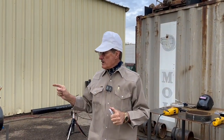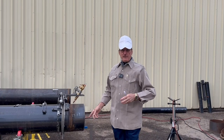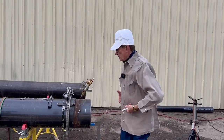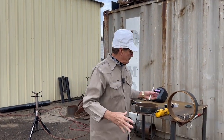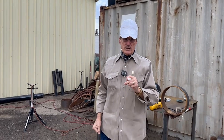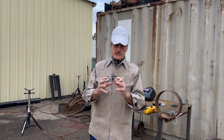Now why is that important? High-low. If you're new and don't know what high-low is: pipe is egg-shaped when it comes from the factory. It's only guaranteed for so many inches to be truly true to that dimension — after that it's allowed some tolerance and it can be like this. We call it egg-shaped. This pipe is not completely round; it can be a little bit or a whole lot. Sometimes you get coupons cut in the middle of a joint and it literally looks like an oval. So when you mate them together you'll have a ridge in different places, making it hard to take a good test. That's why when you're cutting, you want to cut them as matched pairs — that way if they're egg-shaped, they'll be equally egg-shaped and you'll get a fit without that high-low problem.